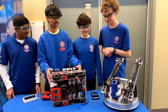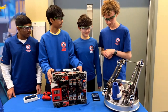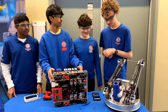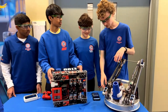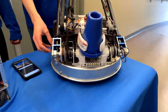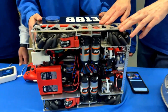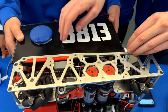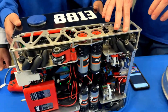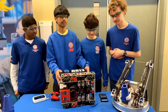From a materials standpoint, would you recommend other teams look at alternative sources like that, or stick to more traditional suppliers like McMaster-Carr or E-Street Plastics? We would not really recommend using a cake pan because it's lower-grade aluminum — it's very gummy and doesn't machine well. For this robot, the black panels on top are recycled euroboard from past game fields, and the aluminum we got from eBay. We haven't noticed any serious problems sourcing materials that way.